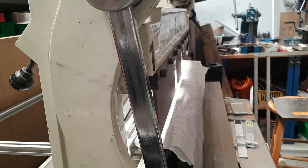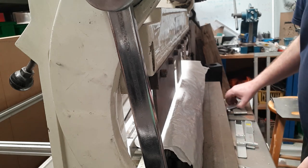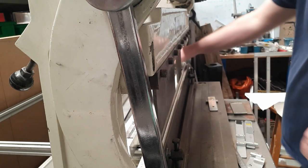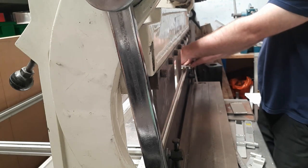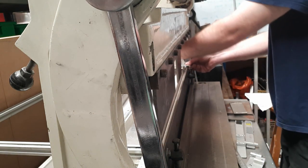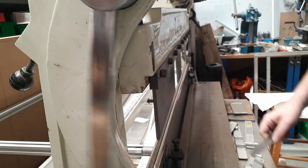I'm going to get the fence set up for the next element. I always consult the drawing and double-check every time — this one is an 80. I'm looking for an 80 and I'm not sure I have that jig, so let me go and find one. Okay, found one that's close enough to the 80. I'll loosen the arms off, insert it, and just nudge it tight for a minute because I need to get this one level as well — you may have to go back and forward sometimes. I'll pop in the rear lane and double-check — that's 80mm.